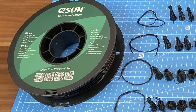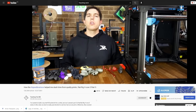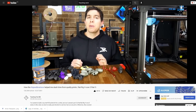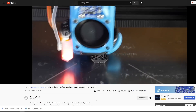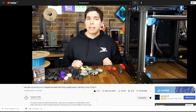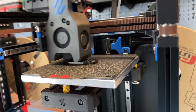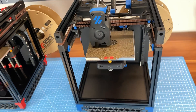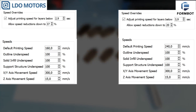As PLA in general is very demanding for cooling, let's change materials for this Benchy. Michael from Teaching Tech proved that Volcano PLA is easier to cool than regular PLA. This is going to soften the bottleneck in order to put emphasis on extrusion and speed. I repeated the procedures for the speed settings in relation to extrusion flow and cooling for Volcano PLA. As expected, Volcano PLA gives us faster layer times as well as faster speeds for small features.